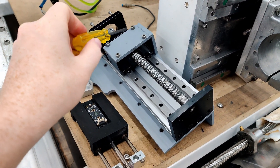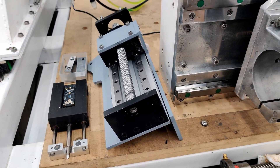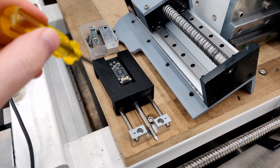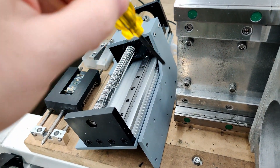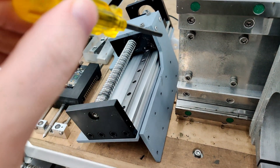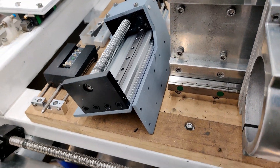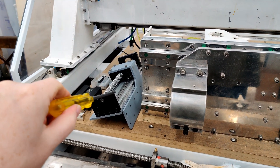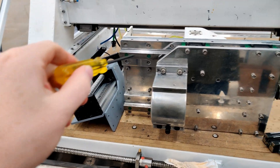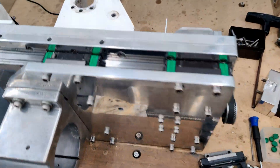I have a bunch of quarter-inch steel — all the gray stuff painted with primer is that material. What I'm thinking of doing is keeping this thing off and on this side making it a little more rigid. I'm going to attach a 3D probe and use that as my probing system. One of the issues I'll run into is the ball screw is not that great, so I'm actually going to replace it with a double-nut one.